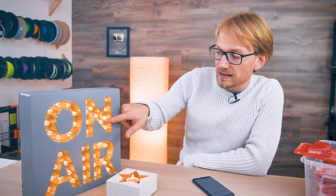One more thing I'd do differently on the larger sign is the electrical work and the bulbs. These bulbs were not the best choice — they're way, way brighter than needed. Also, these are 240V bulbs running off mains, and apparently wet plaster is conductive. When I installed the sockets, something was touching the still-wet plaster and this entire thing was live — I measured 220V to ground on it. Not safe. Don't do this at home. A much better choice would be Christmas tree lights: small insulated LED strings, way less light output, and you can still stick them through holes to create the same effect.